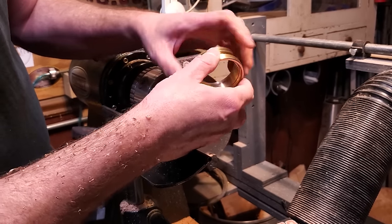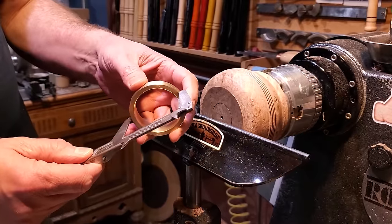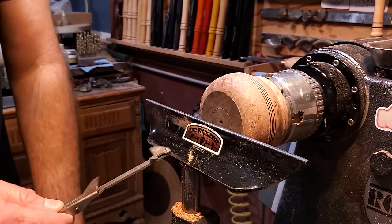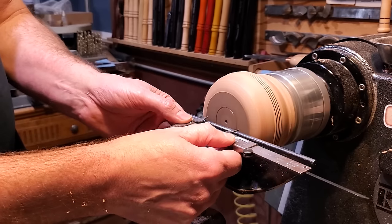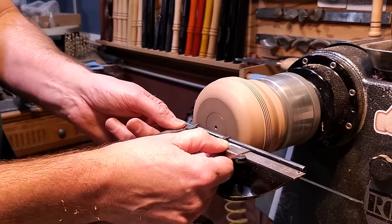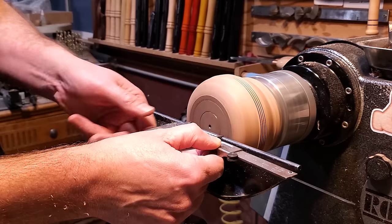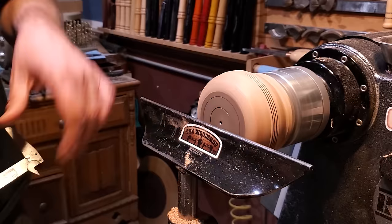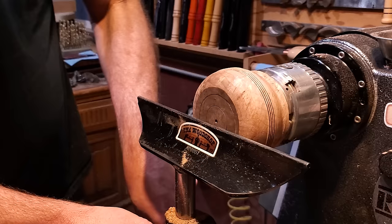When they're made, they're together like that, so that catches that way, so that way it grabs a hold of the wood. Let me get the calipers and we will figure out what the diameter is right there. All right, calipers. So I'm going to make it a little bit smaller than this so I don't go too far over. Take your calipers up there, turn the lathe speed on. You only want to touch on this side, put it down to the tool rest, and you can see where it shows up on the other side. So that's a little big. You can see you're not touching this one, but you can see when it lines back up. There's our size right there. That's going to be a little bit small, so we don't go crazy and make it too big.